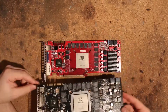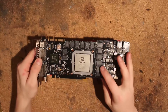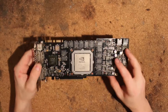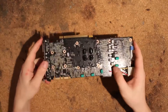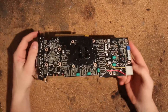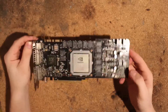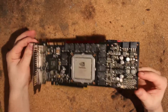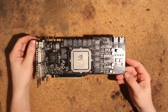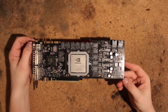Because this reference card also has Samsung memory, and that one cold bugs and this one doesn't. Like if I put these two cards in SLI, it's going to start artifacting as soon as I cool this down. I retried this I think 3 times because I always thought I had condensation somewhere, since I don't really dip the card completely. But every time it started on LN2 and ran fine on ambient — however it kind of sucks on ambient, I think this GPU barely does 700 on ambient. Maybe don't get reference cards. There are some decent scores on HWBot though, but they might all be e-powered ones.